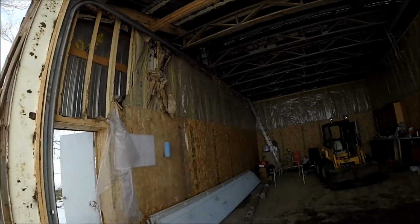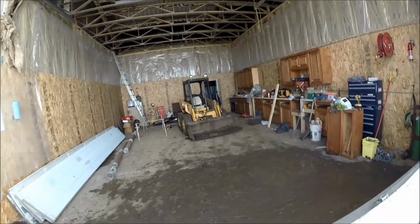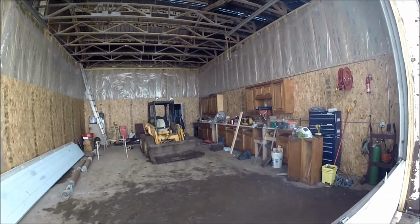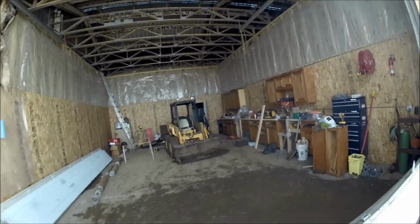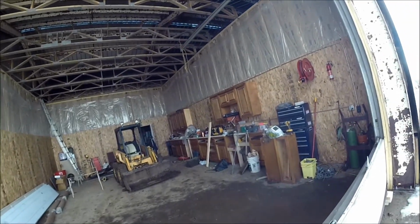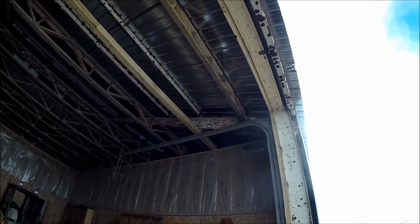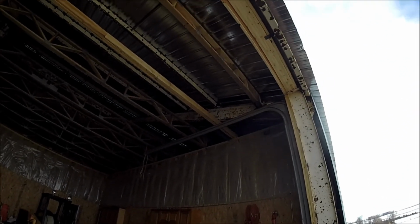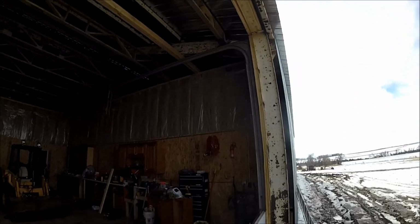If I get anything actually done today, maybe I'll give you a little bit of an update. But it's real nice to have all the power down here. Like you said, I don't remember if that was done in the last episode or not, but I've got all the outlets on this side wired in. Everything's hooked up. I got my bench grinder, my drill press, my chop saw. It's great. I can do what I need to do. I can weld if I need to weld. When I put that bracket up there, I had to tack weld it into place before I could blow the holes, because it was just too heavy to hold up there and do both. And so it's just real nice to have the welder down here and do that. We get the air hose reel put in. I don't have it plumbed yet.